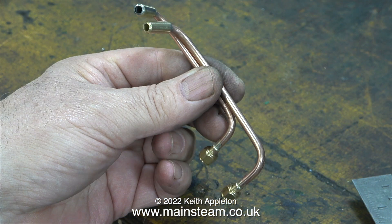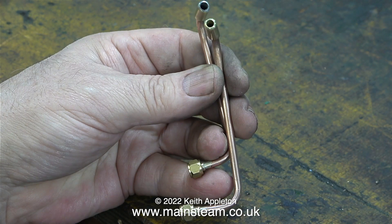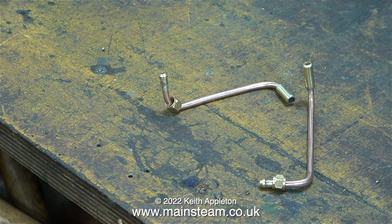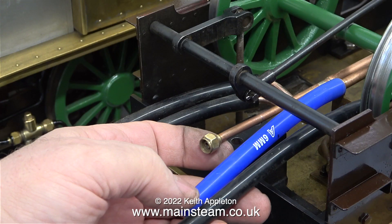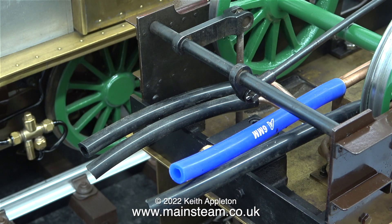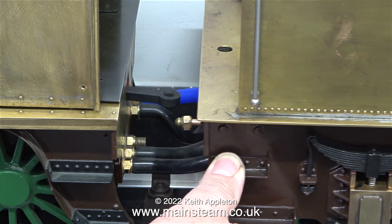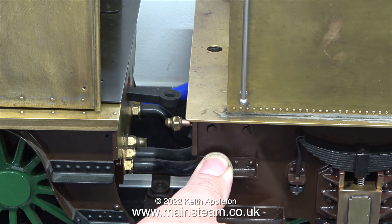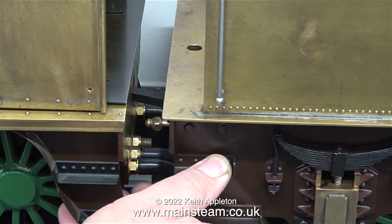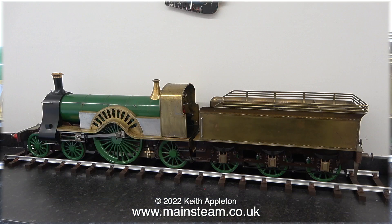Here are the pipes once cleaned up with the Brasso. As you can see, both pipes are a different length. I'm just measuring to make sure they're okay — and yes, they should fit perfectly. When the pipes are tightened down onto the valves, they are approximately one inch apart, but at the other end they need to be less than one inch apart. I decided to fit a piece of blue silicone rubber tubing, which is a larger gauge, on the main feed pipe, and five millimetre internal diameter pipes on the rest of the fittings. Now I can fit all the pipes to the engine, including the pressure feed, and push the tender up to the engine without the pipes kinking.